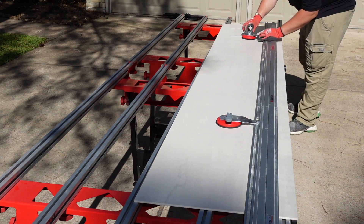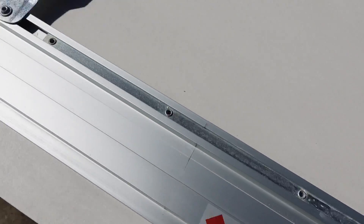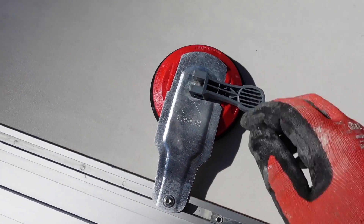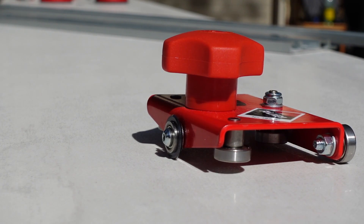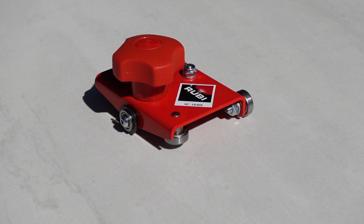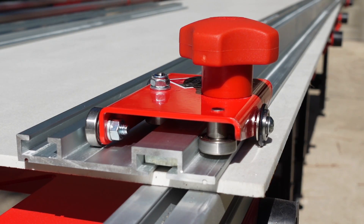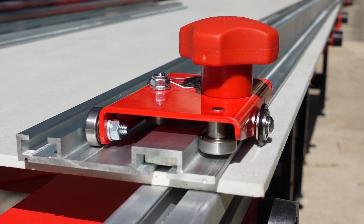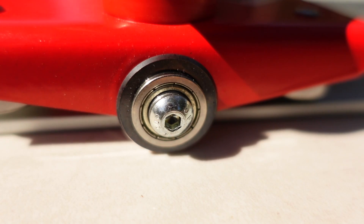You want to place the suction cups equally apart from the edge of the piece to be cut to stabilize the system. After some experience working with the cutting system, you may decide that the suction cups are not needed. The scoring carriage or cutter is a simple and easy to use scoring head built around the idea of palm pressure. You have four bearings attached at the factory, a knob to rest your hand atop for pressure, and the cutting wheel. No springs, no levers — that's it.